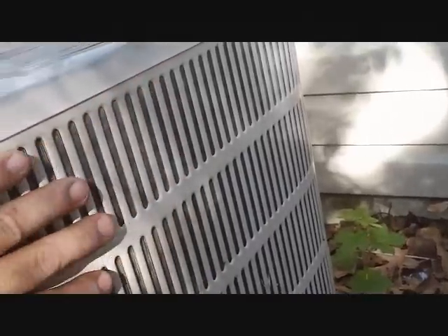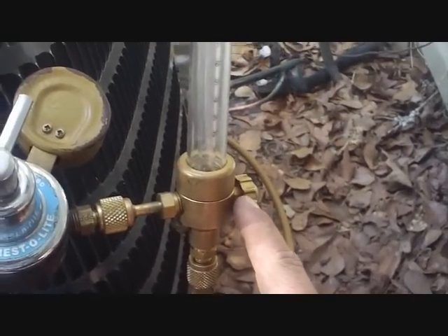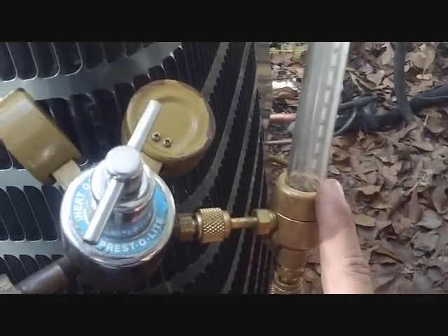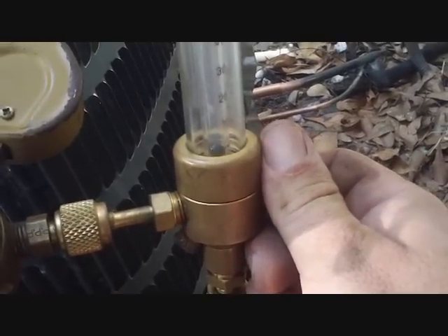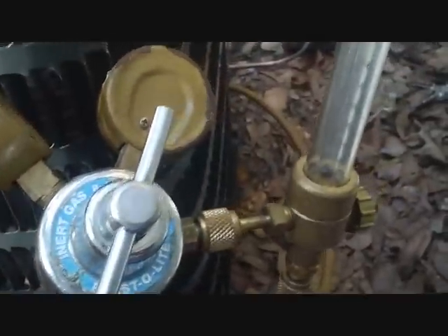I know what's going to be done about it. Got the flow meter hooked up. I'm going to take it up to about 5 PSI. It'll displace all the other gases in the line and cause there to be no scale buildup whenever I braze — that's the idea. I'll turn it up to around 5 and let it run for about a minute after I get done brazing too, just to make sure. There's our regulator. Let's get it brazing.